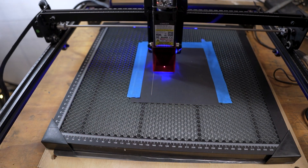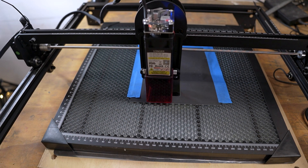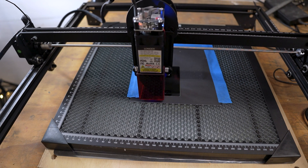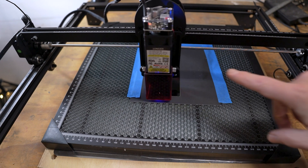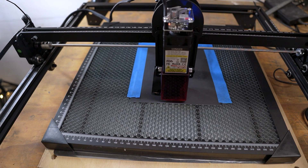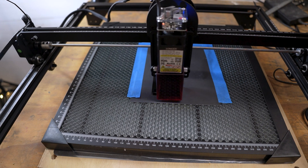So just a quick line etch, and there we go — line the business card up. As far as settings, I'm using 4,500 millimeters a minute for the speed and 20% power. And the other thing you definitely want to do is make sure your laser is focused very well on your project. So let that run — it's saying it's going to take about 13 minutes or so.